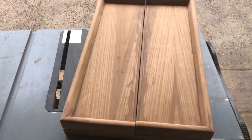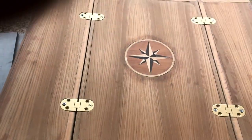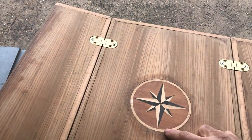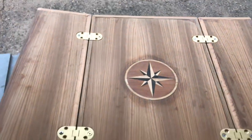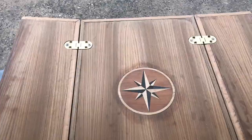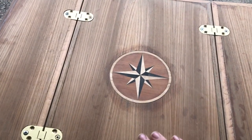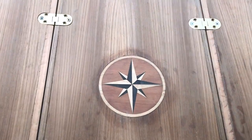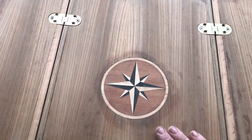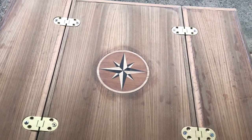If you've seen any of my other videos it won't surprise you to see this next part — yet another inlay. I started with just placing it on top, drawing around it, then cutting out or just scoring the line with a razor blade, and then cutting the veneer with the dremel, then epoxying it down with unthickened epoxy. This one actually came out much better than the other ones — I guess I'm getting better at it. No real gaps here between the inlay and the plywood.